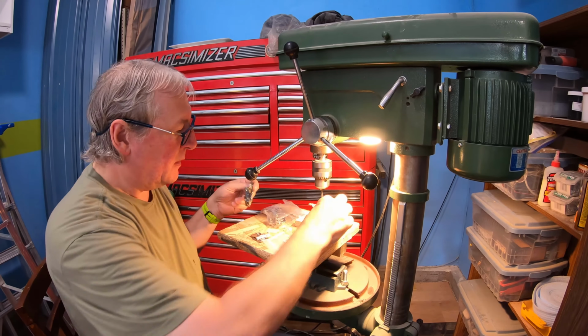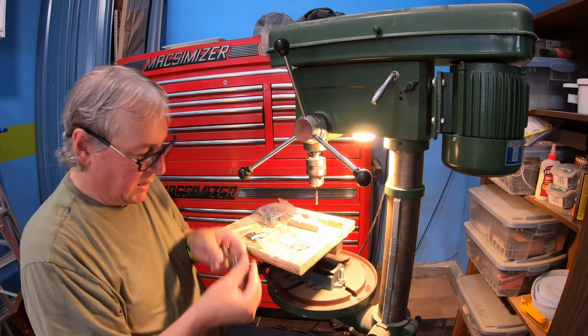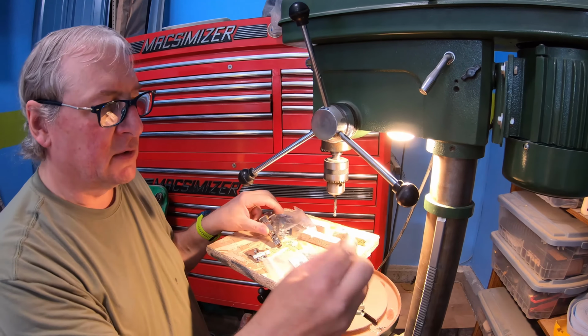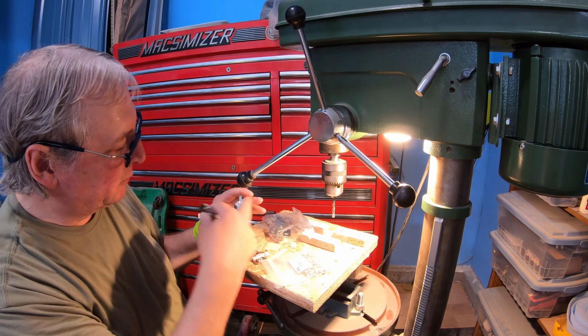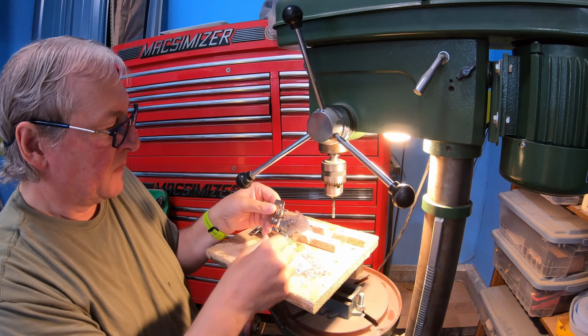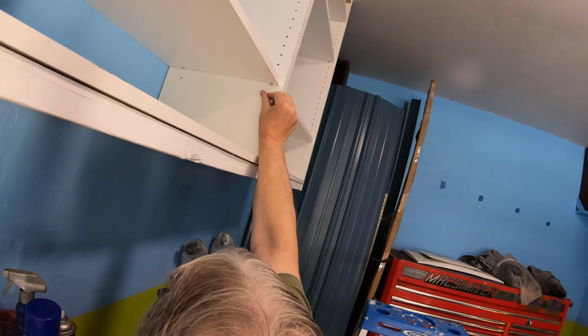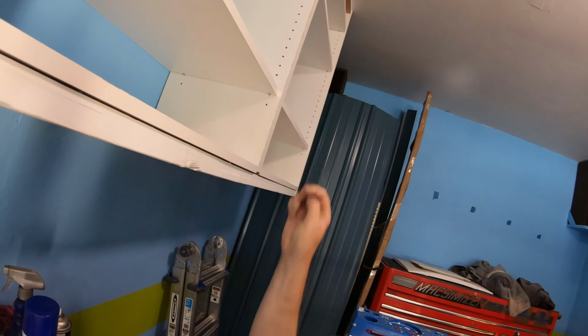We've drilled holes up inside the cabinets, and these are soft close hinges. They're the right hinge. This is the part that goes on the cabinet. This part attaches to the door. We've drilled those out. We've got these screws that fit into the holes that we've drilled. The screws to attach these to the doors do not go through, but these are threaded to fit in these holes here and hold the hinge in place. And the spacing is the proper spacing for these hinges, from the jig we used. The European spacing.